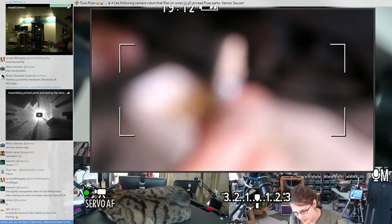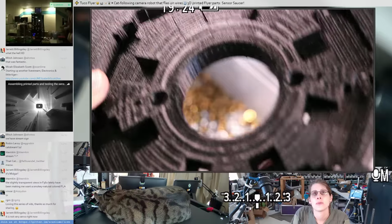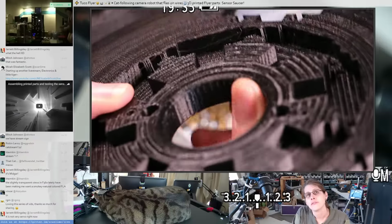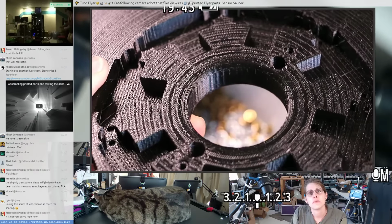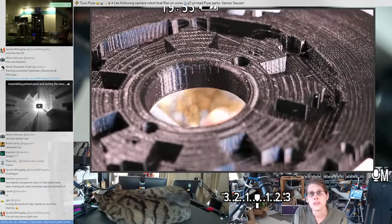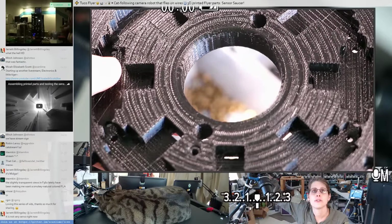Oh, I think I really got to show this part of the CAD, but I'm liking how I ended up using this central hole. Oh, that didn't focus at all, did it? I'm liking how this central hole in the saucer ended up working out. Since it's pretty oversized, I just didn't need this material for anything anyway, so I gave it a decent amount of material to hold the carbon fiber rod, but then just took out a circle here. But it left plenty of room for the umbilical cable for the robot, and then also enough room that I could take all the wiring I need for the top side. So the sensor wiring has to go back down to the microcontroller, and then there's also wiring for some LEDs on the top, and so all that can actually go around the perimeter here. So there's actually a concentric bundle of cables where the sensors go on the outside, and then the leash goes on the inside.